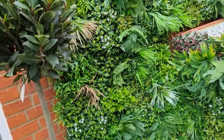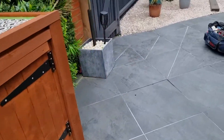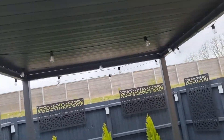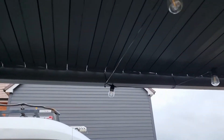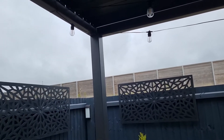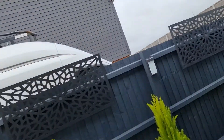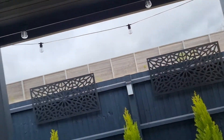I'm going to come out behind this, then run low level along the floor, under the gate, along here — and this is the pagoda. We're going to put a heater there and one heater up there, and on that post we're going to put two switch spurs — external switch spurs — so each one can be individually controlled. The heaters themselves have got controls on them, remote controls.